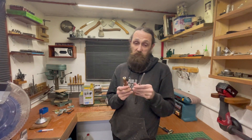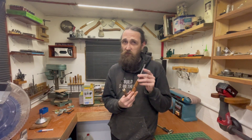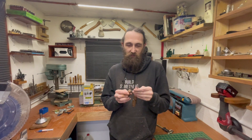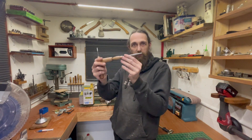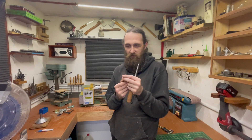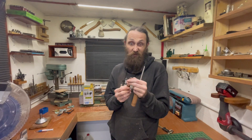Not bad - pretty happy with it. Using the carbide rods to make tools - I would say it was a lot harder making this one, but they were both pretty easy to make overall. Just getting the angles right, getting that bottom angle right, which I'm sure is around about 30 degrees, but I just eyeballed it. Angles are everything - if you get the angle too steep it will not cut properly - but in my experience, a sharp bit of metal at whatever angle will cut. Alright guys, I hope you've enjoyed that - it was definitely a cool wee project. I like making tools and then developing that tool further to be a more functional, better product. We'll see you in the next one - take it easy, God bless!